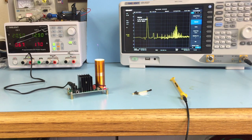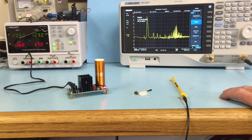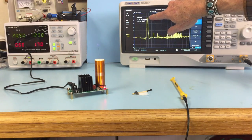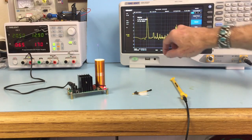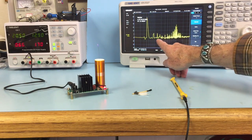Now because I also deal in electromagnetic compatibility, I have my spectrum analyzer here. You can see that the main oscillator is oscillating at about 4.27 megahertz and it's a pretty strong signal. You can also see the second, third, and fourth harmonics pretty easily.